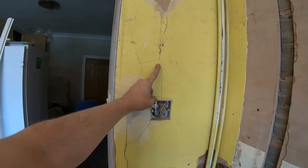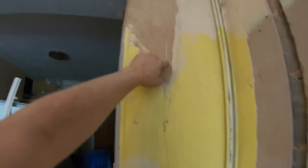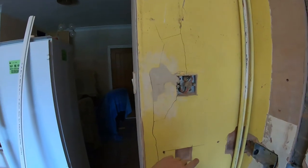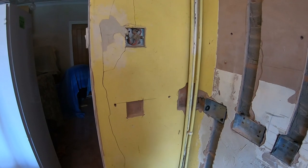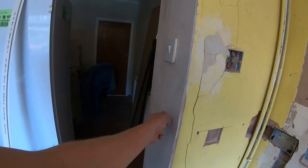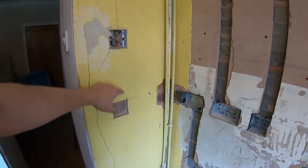So what's going to happen with this now is I'm going to extend, rip all this out, rechase this. It's in capping anyway, you can just see it there. Drop the box down the same height as the socket, so it's all sort of in line and level. Purely the fact I don't want to put it around there. There's no zoning. I can't run it down because there's a big metal steel there now. So drill this in, drill this up,